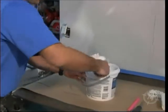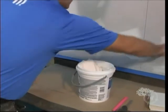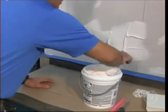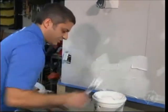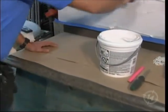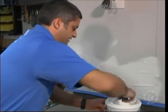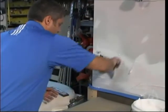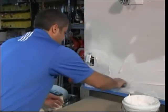Time for the mastic. You basically just want to get it on, then use your trowel to smooth it out and comb in the ridges. Everything is washable with water, but make sure you've got your countertop covered with tape — it's very important to work neat. What I often hear is complaints about hiring a contractor who ends up damaging the countertop or nicking walls, so it's very important for the trades to be conscientious in people's homes.